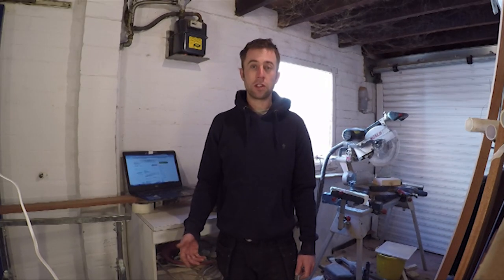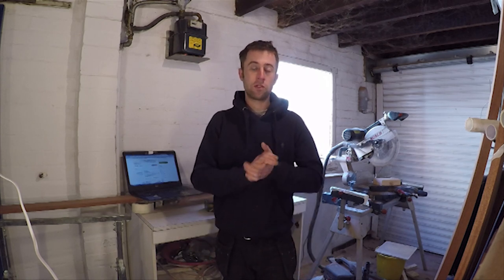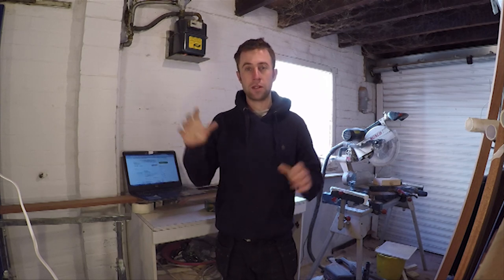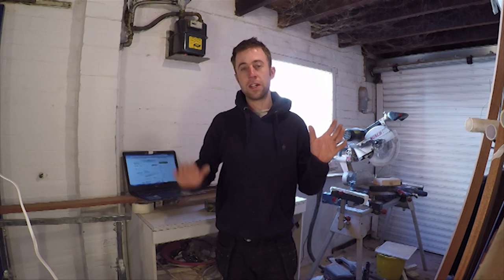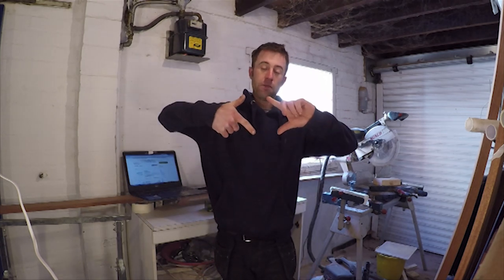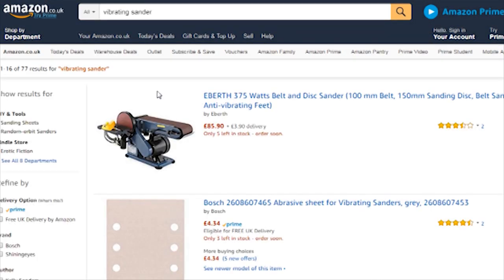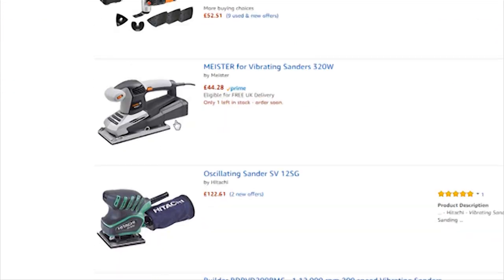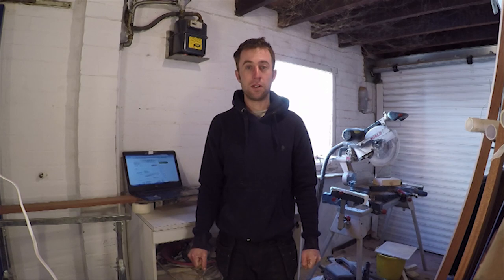A few other things I had to do to sort out my plaster: because it was my first time plastering, the first couple of walls had lumps and bumps all over them. Instead of sanding them individually, I got a vibrating sander with a pad where you attach some sandpaper and just do the whole wall. It creates a lot of dust but it's spot on - I've painted it now and it looks great.